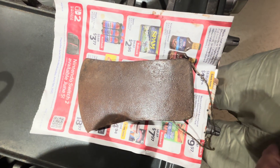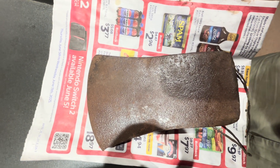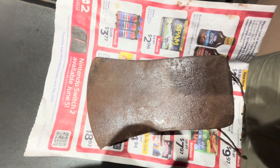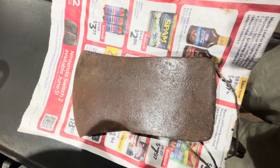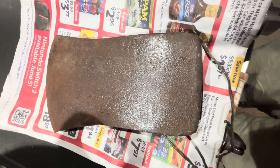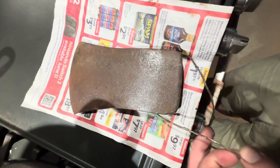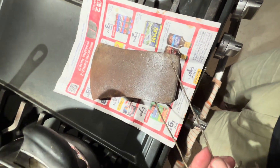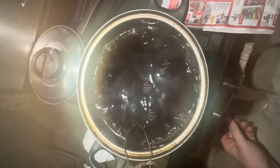I'm about to put it into the boiling tannin solution. Off camera, I've re-profiled the bit to sort out the worn toe, and I've put a little rust bluing solution on the shiny spots where I peened the poll. Now it's ready to go in — I've got a string attached through the eye to make it easier to handle. In it goes. I'll crank this up, bring it to a boil, and check it at around half an hour to an hour.